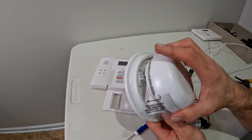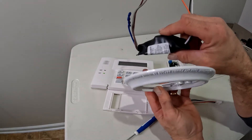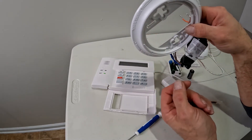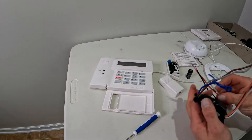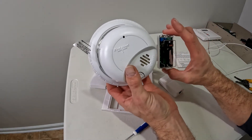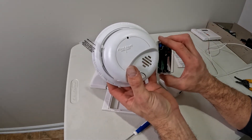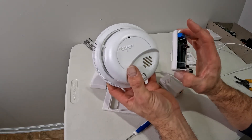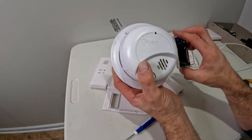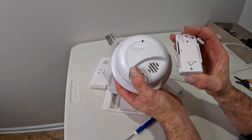Take down your old electrician smoke detector — unscrew a quarter turn, pull it off. I always take the plate off because it's easier to put everything on later since all your wiring goes up inside the box. If you loosen the screws a little bit it should come off the ceiling. I'm going to run the wires out of the back of the sensor, loop it underneath the lip of the smoke detector, and mount it right beside it. Normally the sticky pad that comes with the sensor will hold it up there, but if you've got a textured ceiling you'll probably need a sheetrock screw.